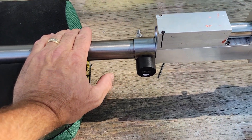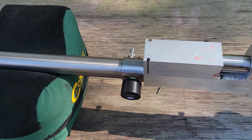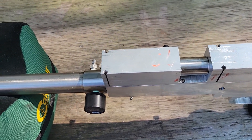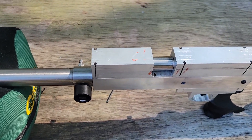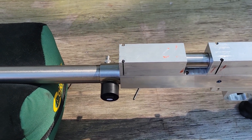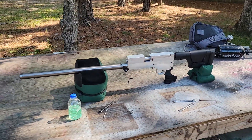It's been sitting for almost an hour and it's lost about 10 more PSI, so we still got a little bit of a leak. As you use the valve and keep pressure against it, it starts conforming to the valve body and helps sealing up. We may have to lap it some more, but otherwise she's looking good. Thanks for watching.